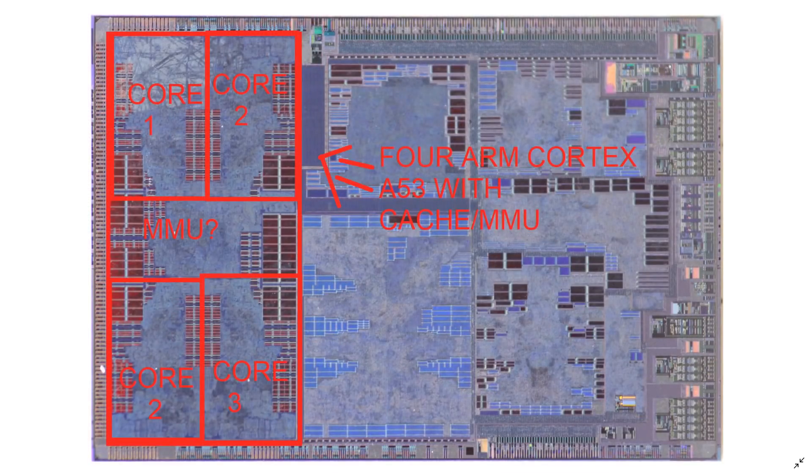The Cortex A53 is quite a decent processor. There are four of them on the chip, and if you ever do reverse engineer silicon, the first thing you do - if someone tells you it's four, you look for four. You can see very much of a repeating pattern here, and each of these is an A53 core. The gray area is digital logic gates laid out automatically. The darker areas are SRAMs, and occasionally a ROM. Most of these are SRAMs, and sometimes they look different in color because they're different - sometimes single or dual ported, depending on the application.